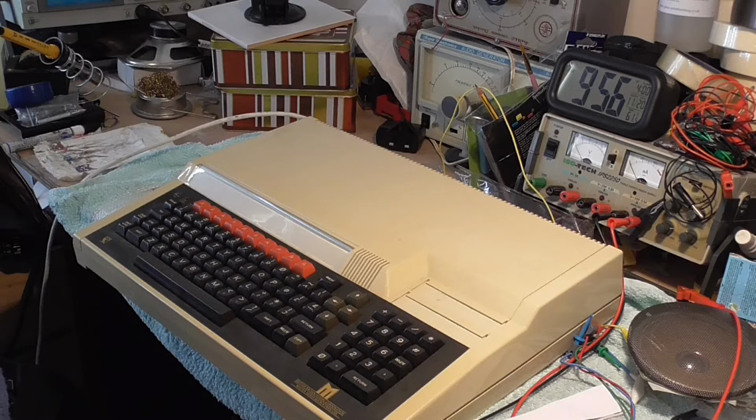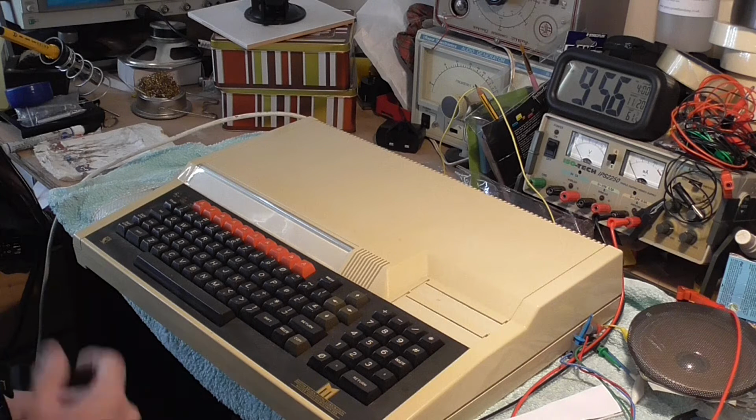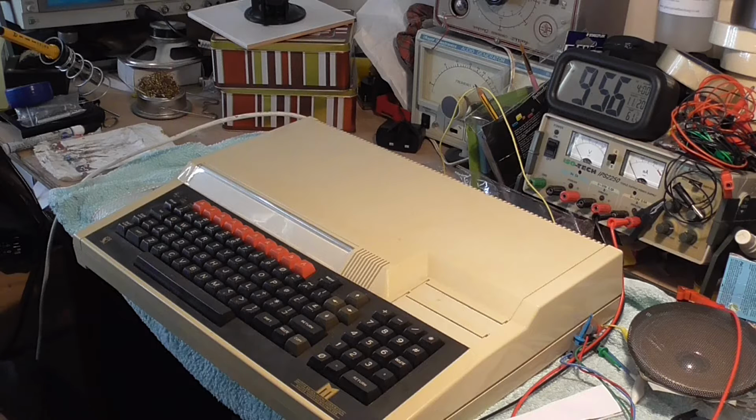So every now and again, no set time, we'll test the batteries to see whether we've caught it in time. We have to change over the BIOS batteries because they are not rechargeable. In a modern PC these days, you would have a battery which is in the computer all the time, and when you switch on, it charges it up. On these, it has a battery to keep the BIOS settings, but it is not a rechargeable battery and there's no facility to charge it up, so you have to actually physically put batteries in.